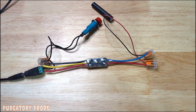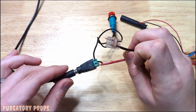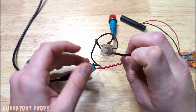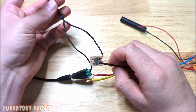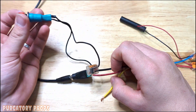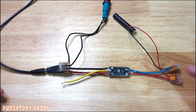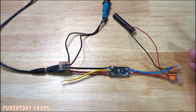Here's an example of what the embedded might look like in use. We've got a simple DC power supply to screw terminal, and we have a button controlling the negative — the positive is just hooked directly up. So when we press this button, power will be connected to the controller and it'll turn on and play our animation. The output can be anything: horns, solenoids, or LEDs.